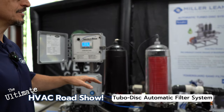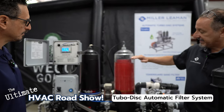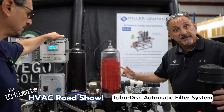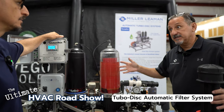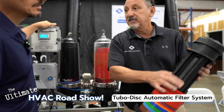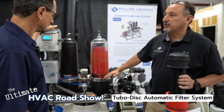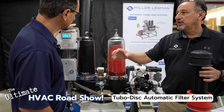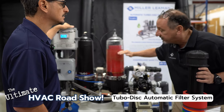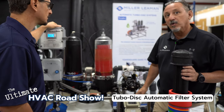So what's happening: the water was up high with all the particulate. What we do is add a little bit of air — around 5 PSI — to push out all the water. Those 120 jets that sprayed out spray into air. They're located right here on these spines. It's reversing the flow, and by pushing the water out into air — like if you spray someone with a hose out of the water — you feel the impact. So we force all the water and contaminants out into air, which is much more effective than spraying into water.